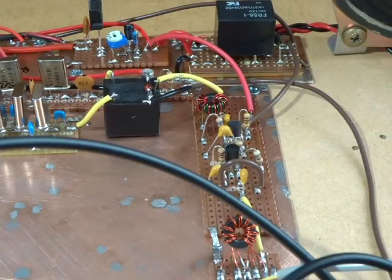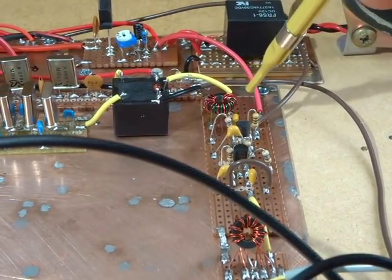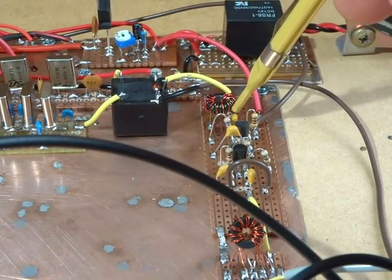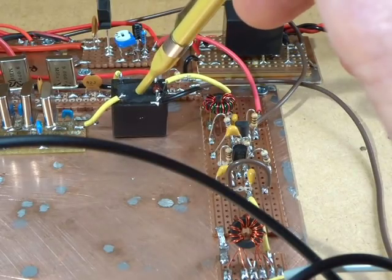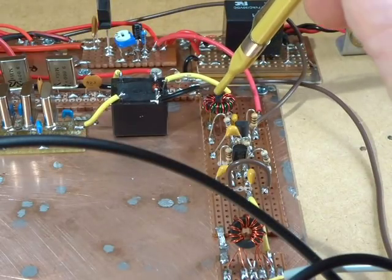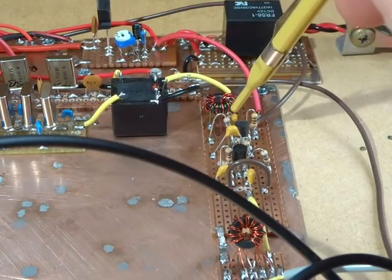Yeah, nothing else to say there, exactly the same, no changes. Except, in fact, there is actually one change. In this particular case now, there is impedance matching for the input. So the input is now matching 50 ohms through to our 200 ohms, which was the design for the two crystal filters. Again, 12 turns on the crystal side, and 6 turns on the amplifier side.